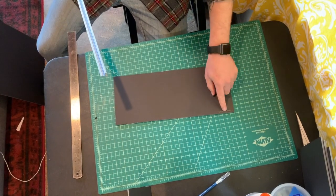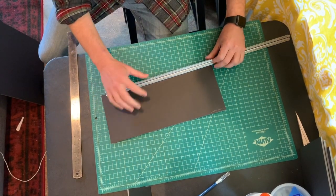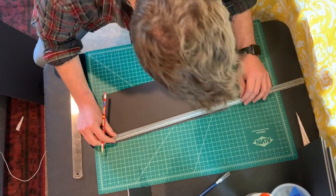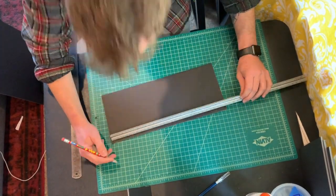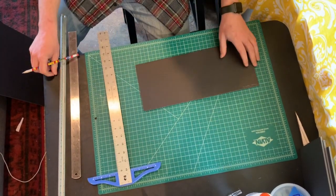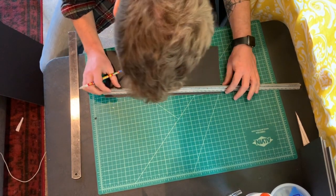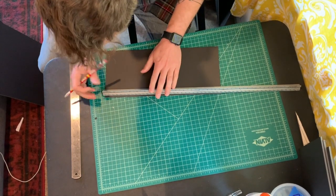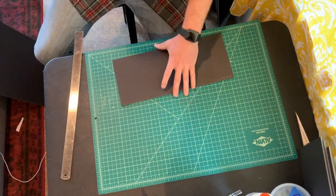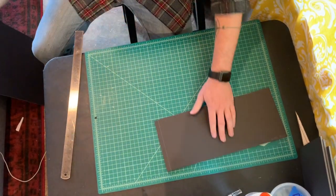Find the quarter-inch scale, find 58, put that at the edge, mark one side at 58, second side at 58, and line them up. Something went wrong there — and that's exactly where the T-square helps you find what you're doing wrong. That was just plain old wrong. Now that I've made the adjustment, I can take the T-square and line up those two marks accurately. Amazing what a little self-adjustment does. If you're moving through this hurrying, you won't catch those mistakes and you'll end up with a wonky cut.